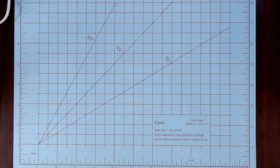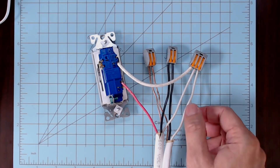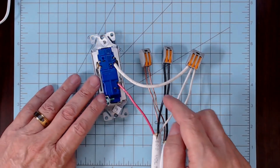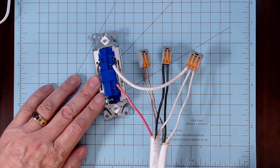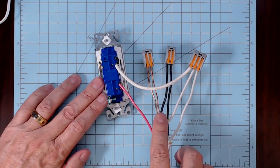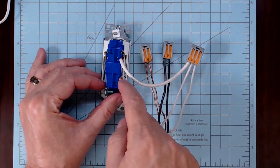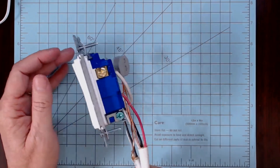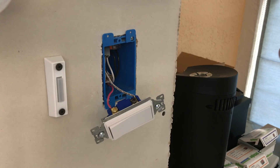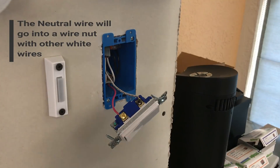Marking this up outside the box for clarity: inside the secondary box, you have 14-3 coming in. The white wires from both the 14-2 and 14-3 will likely already be in a wire nut — you'll need a jumper from there to the black common terminal on the three-way switch. Ground wires connect together. The black load wiring that comes from the smart switch goes up to the lighting. Bypass that black traveler wire with a wire nut, and the red traveler wire goes into the bronze terminal. The white wire goes into the black terminal and the red wire into the bronze terminal — then tuck the switch back into the box.